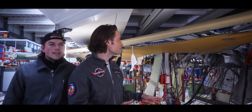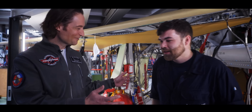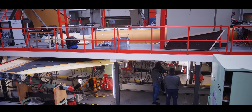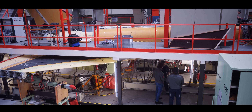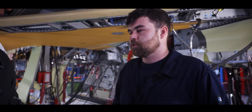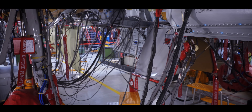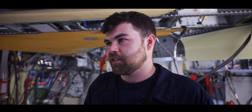There are a lot of cables hanging out of this Eurofighter. What is it all about? This is the third section of our final assembly from the Typhoon — we have our high voltage testing station. We have generators in the cellar that provide about 1,000 volts to every connector on this aircraft, and we check every connection to make sure it's right. How long does that take? This section takes about two weeks.